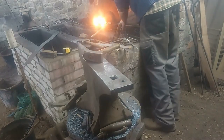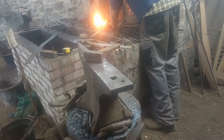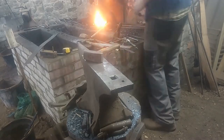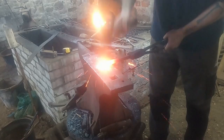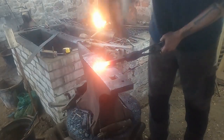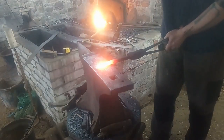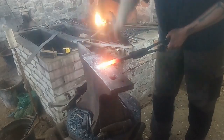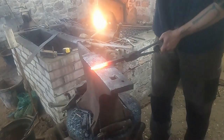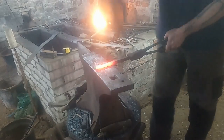You can see we're getting a good heat on this bar. We're starting off with a 16mm square bar of wrought iron from an old piece of fencing. Working this, we've found that if you work on one face it's okay, but on another face, unless you've got it incredibly hot, it tends to delaminate as you forge. So we're always trying to get this up to a very high temperature, and once we've got it, we roll with it and keep that heat going.